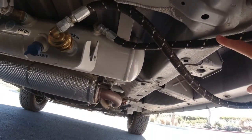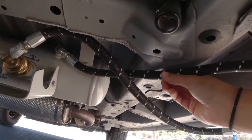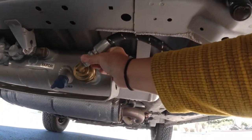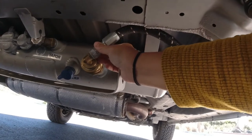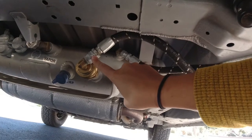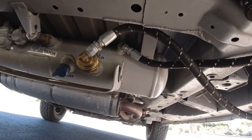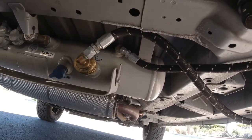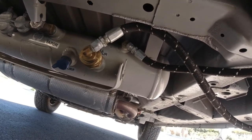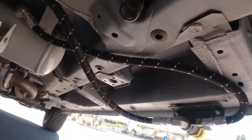It's not difficult to cut — it's a Kevlar rubber tube with a fabric outside, so it feels pretty durable. The one thing you've got to be careful with these fittings is making sure they're all sealed. Some of them are flared fittings and some are standard fittings. You obviously can't use the sealant on the flared fittings — you just have to make them fairly tight but not over tight. We discovered that in our propane journey there's kind of an art to these connections.